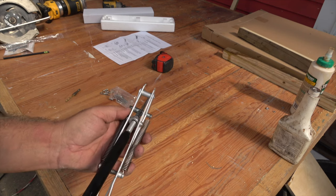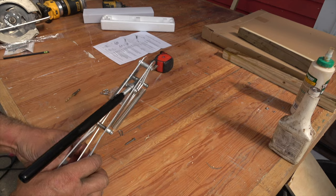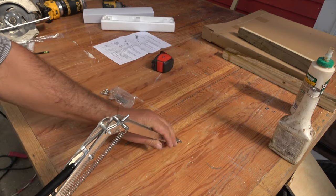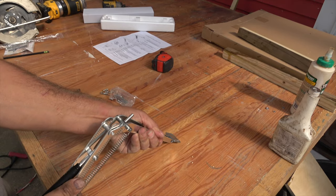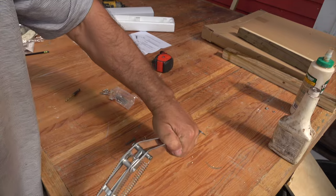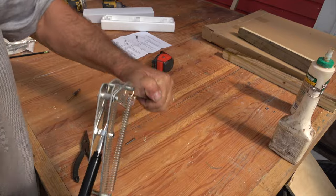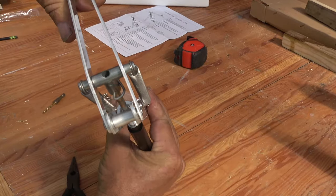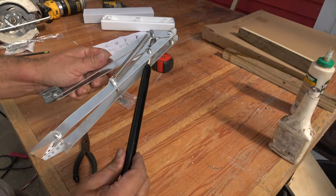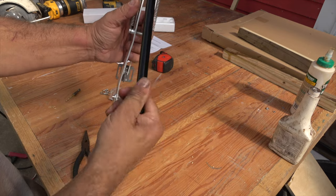The mechanism assembly is not difficult, but I would say it's tricky. You need to screw the cylinder into the housing and then put a pin through the end of the cylinder for the framework — that is the bit that's tricky. A pair of pliers is ideal because I've got fat fingers, but I would encourage you to put the wax-filled cylinder in a freezer box for 10 minutes. It'll cool it down, you can compress it, and it'll be a much easier job.